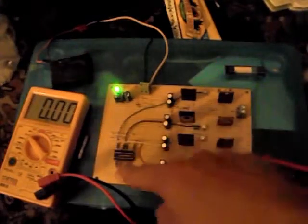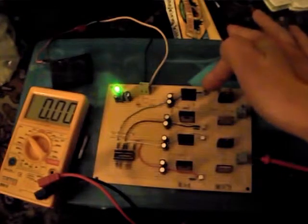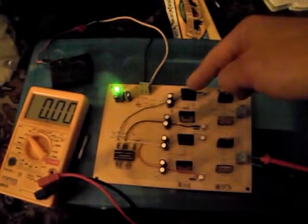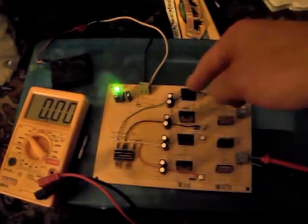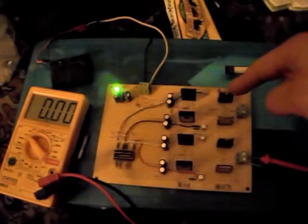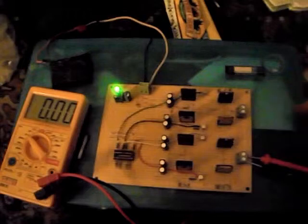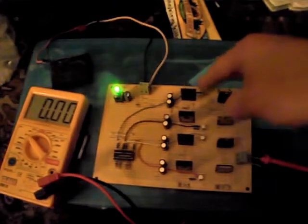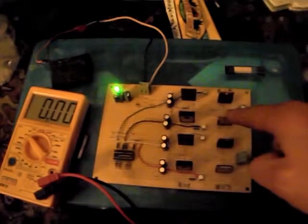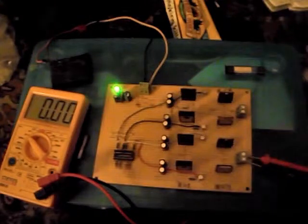So the simple circuit is: this is a 2N2222A or something, which switches a TIP147. And a TIP142. The power goes through here, and then if that one's off and that one's on, you go through this TIP147 through this TIP142 to there, and the same down here.